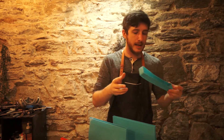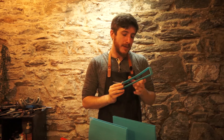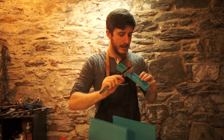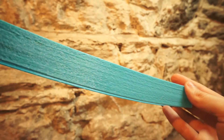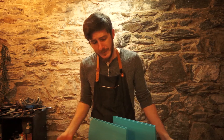I decided to print a single width and ran some experiments. I had serious warping of the parts coming off the bottom of the bed, but I pushed through. Then I took a caliper to check wall thickness and the variance was unacceptable — most of it was sitting between 1.7 and 1.8mm even with flow rate at 115%. I suspect the firmware may be limiting that. There's no way it should be under-extruding. So what was happening? I did a ton of research.